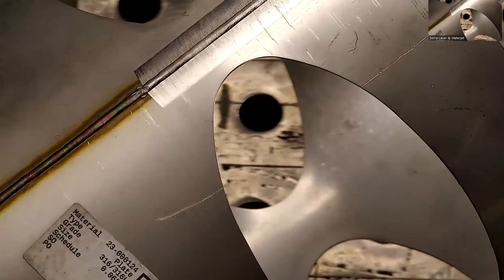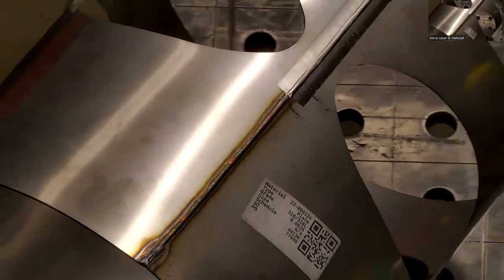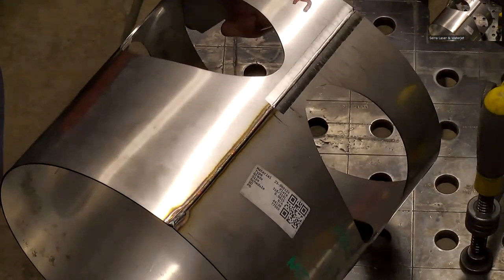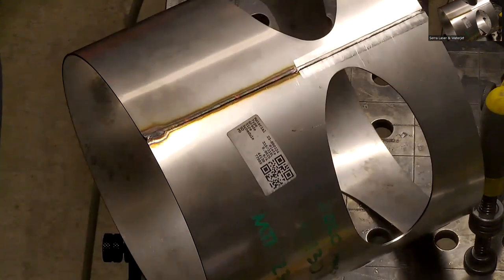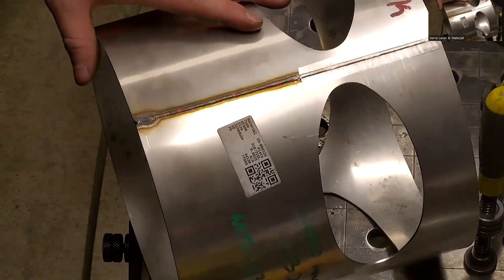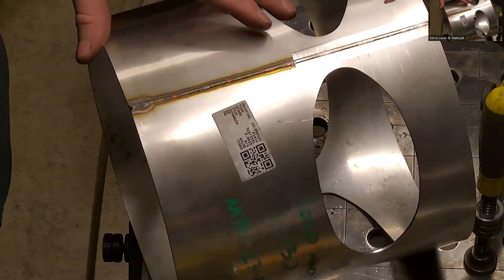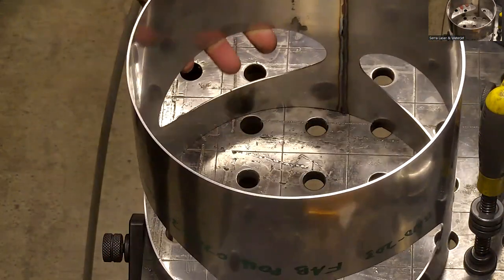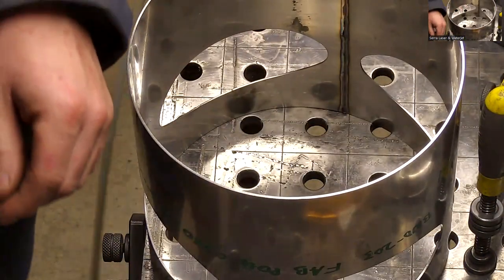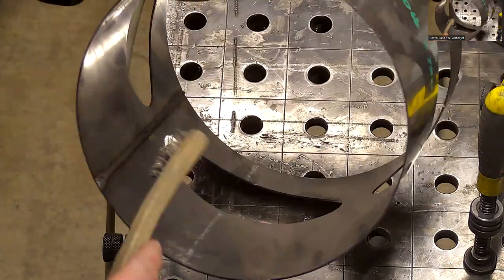stainless there. Okay. So when you weld like that, can you use backing gas to help from sugaring on the backside? Yeah. Okay. I just use nitrogen for that also. You can't use argon on the backside? You can, but nitrogen's better. Nitrogen's the optimal shield gas for stainless steel and steel.